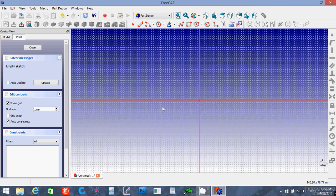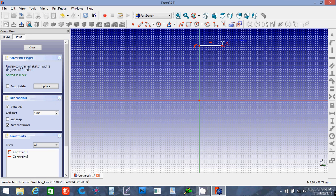So what we're going to do, I'm going to zoom in here a bit, and the first thing I'm going to do is make sure I pin to the Z-axis, draw a line out some, come up here, and you can pretty much do any kind of profile you want. Just try to make sure that, if you make it too steep of an angle, then you're going to have to print it with supports and remove those later. And for instance, you probably don't want to do this. That's going to be a really tight spot to get any supports out of. So I will adjust that back.